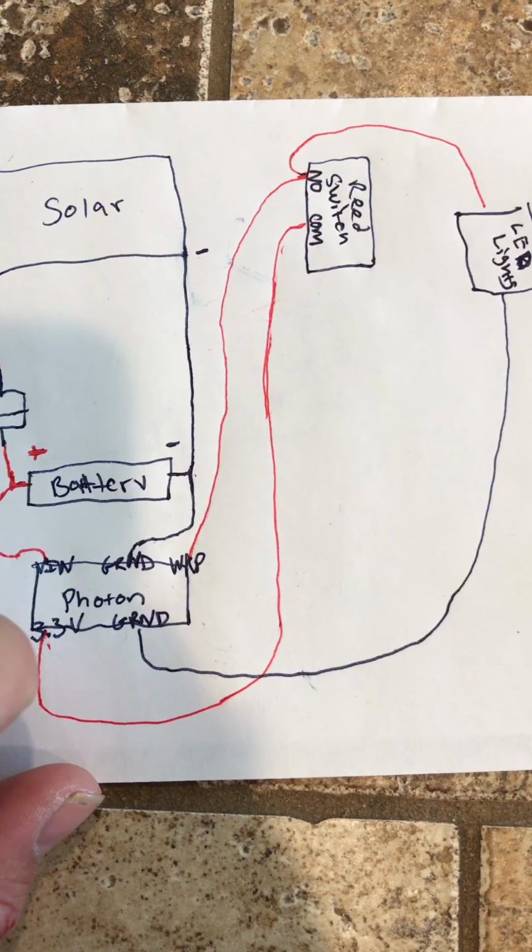My understanding of that section of code is that it does two things. It sets the internal, which is why I don't think I have to in the setup. I didn't, but I guess you could enable the pull down resistor. It has an internal resistor in the Photon, so you don't have to put an external pull up or pull down resistor. Because I set that pin to sleep until wake up pin is rising, I'm pretty sure that activates the pull down resistor on the Photon. I'm not entirely sure, so don't quote me on that.